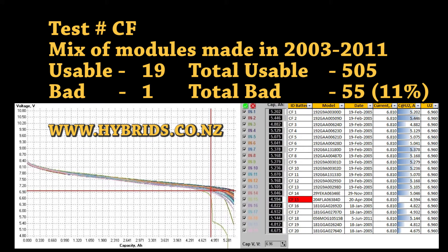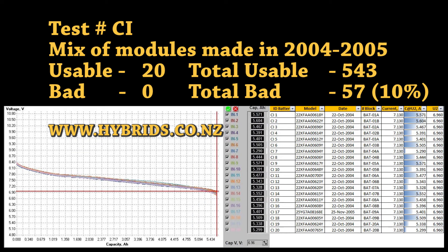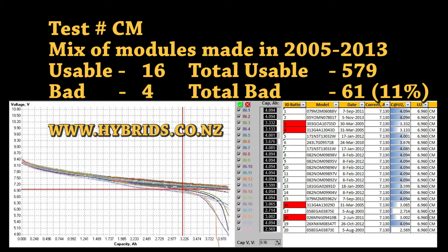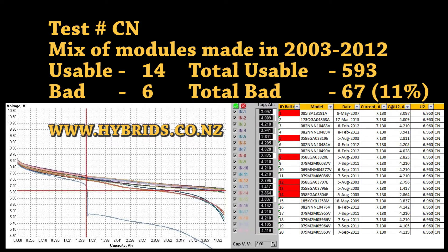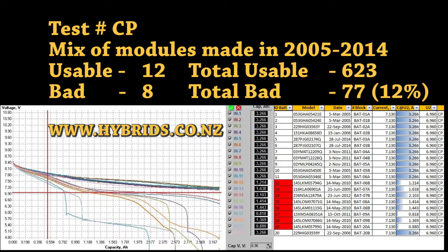When you use a 1A load in your toy RC tool and discharge to lower levels, you will come up with a much higher measured capacity, but will certainly miss failed modules — and that's where the problem is. There are a lot of faulty modules out there tested by toy tools, claiming high capacity but not suitable for battery rebuild. We can say with a high level of certainty, based on our stats, that at least 12% of those modules out there are faulty.